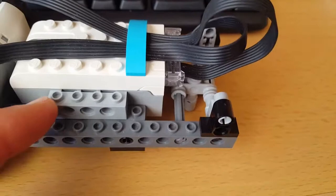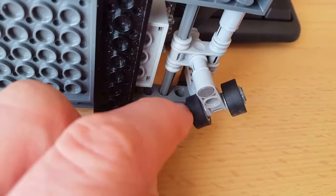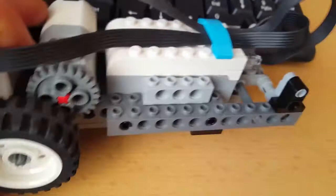As you can see, the smart hub is located in the middle, and it's facing this direction simply because I needed the room for the cables to come out the back. And as you look down below, you can see there's a caster wheel, and the caster wheel basically allows it to move back and forth and swivel in the direction of travel, which is important. Otherwise, you'll get a lockup if you try to make this a stiff wheel in line with basically the swivel axis.